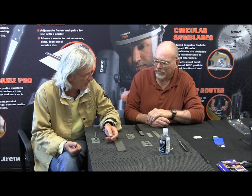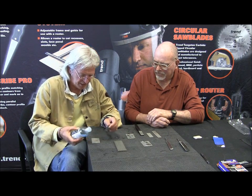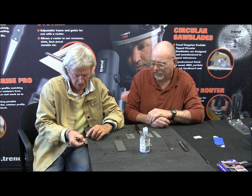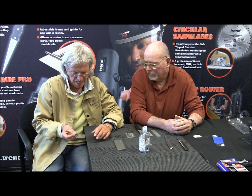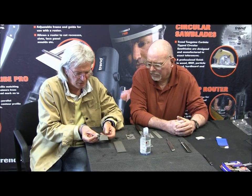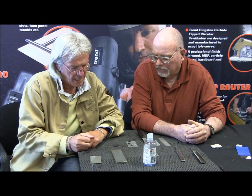They are disposable blades, which again — if they're carbide — I don't personally believe in anything being disposable. Now, if I've got the ability, when I'm sharpening a router cutter for instance, I put it here and I'm purely working on the flat side to sharpen a router bit. The flat side is sharpening that shape all the way around, and that's how you sharpen router bits very successfully and prolong their life by about tenfold.